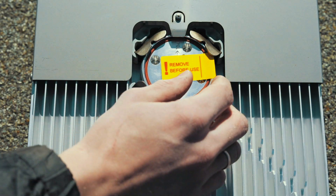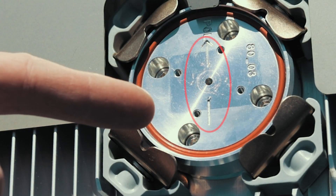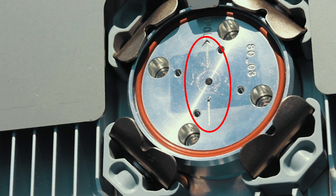Remove the protective sticker and look at the flange before installation. Polarization is shown by the engraved arrow on the flange. We strongly recommend checking polarization before site arrival. To change polarization, refer to the user manual on our website.